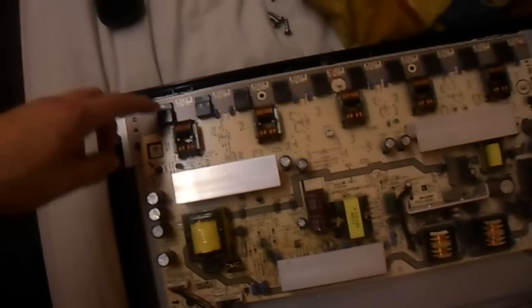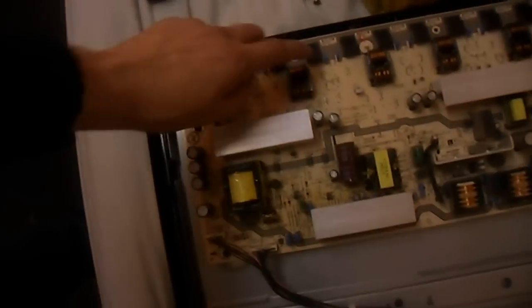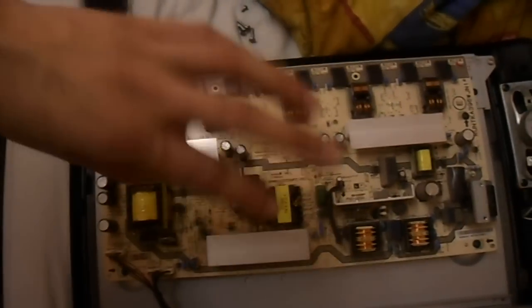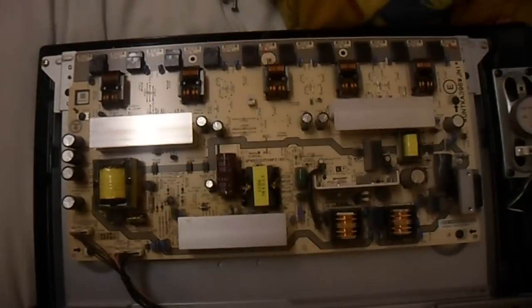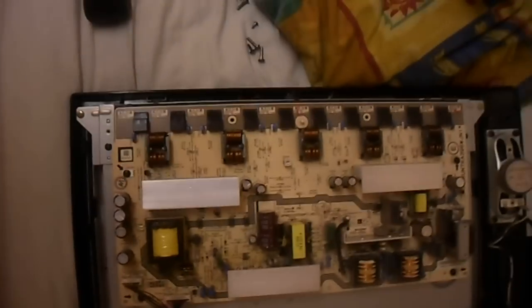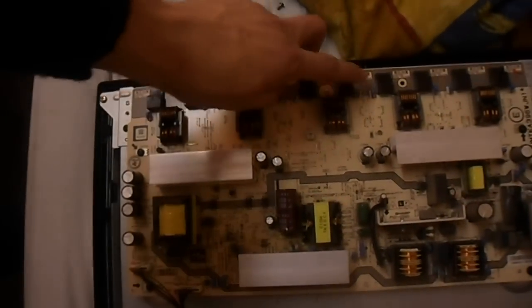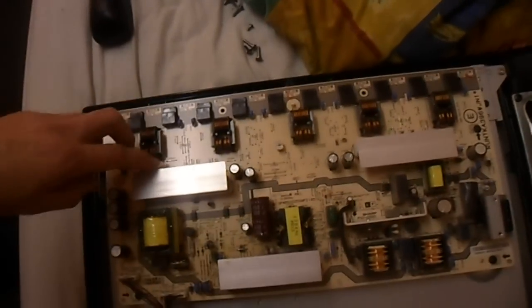What we've got here is ten tubes in the TV, hence ten connectors, driven by five transformers. We need to flip this board upside down and find a capacitor called C7558. We'll fit a shorting link across this and we'll then be able to determine where the defective bulb in the set is, and whether we can leave it with the defective bulb disconnected - we could disconnect it by cutting the trace going to one of the high voltage outputs.